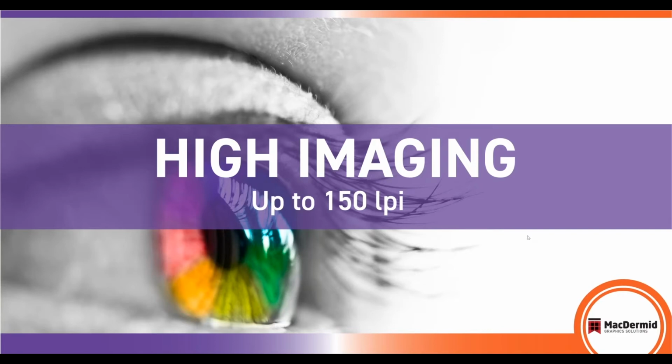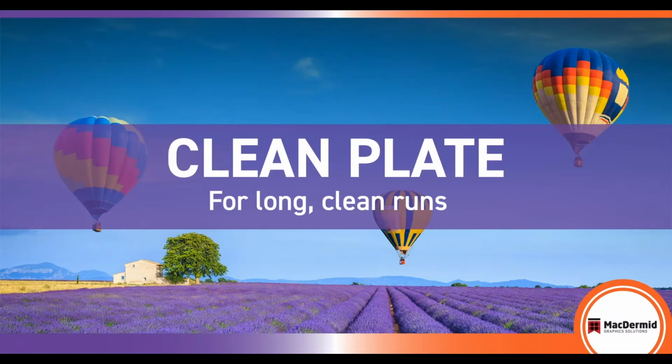So LUX ITP EDGE brings high imaging, as I mentioned, up to 150 line capabilities. And this has allowed our customers to target the litho label market and enable conversion to post-print corrugated. It includes patented clean plate technology for long clean runs between press stops and press wash-ups and shortens overall production times.